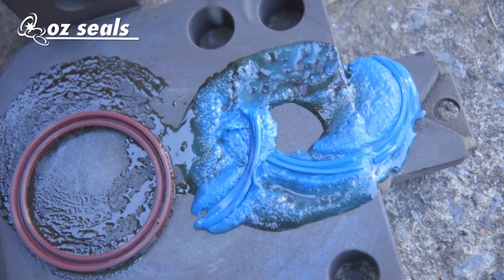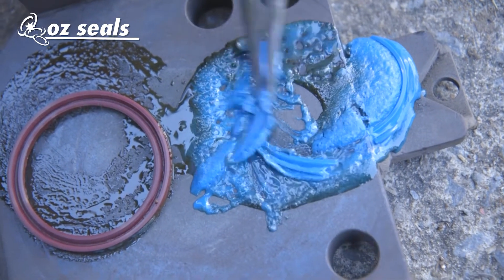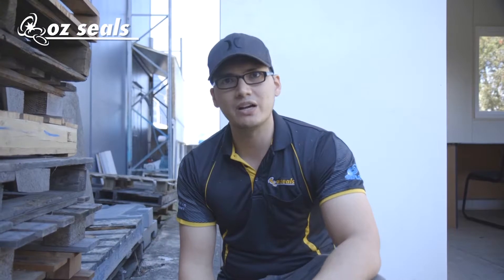So as you can see from the experiment, the thermoplast didn't go too well — it actually melted quite quickly. The reason being is thermoplast is a remeltable polyurethane, so you can remelt that and injection mold all the regrinds or all the flashing that's left behind.